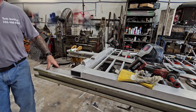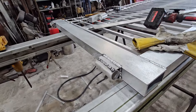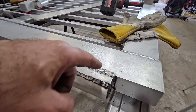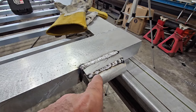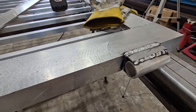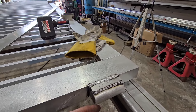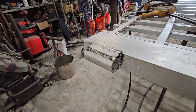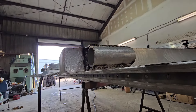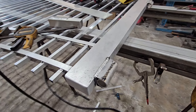The channels get welded all the way around — remember, this is beveled. This gets welded here; that can be left alone but it's welded all the way around. The bottom is not welded because the gate is going to have to be flipped over when we wrap it. So this is both of them, and you can see it's welded all the way around. I'll grind this flat and we'll start the flat bar.